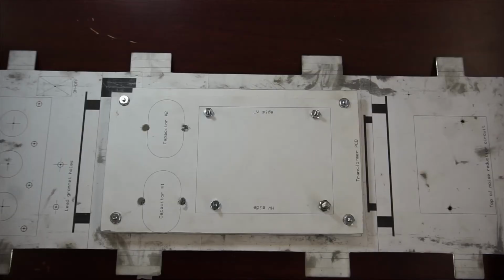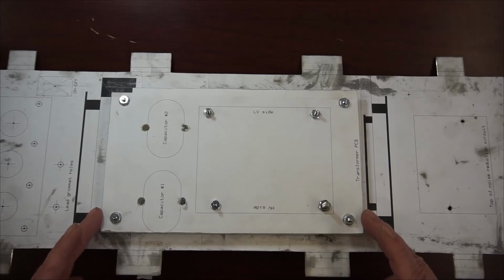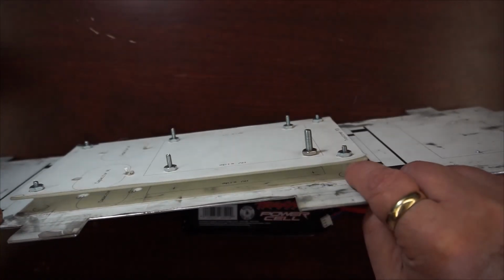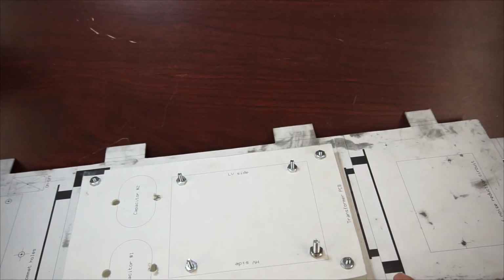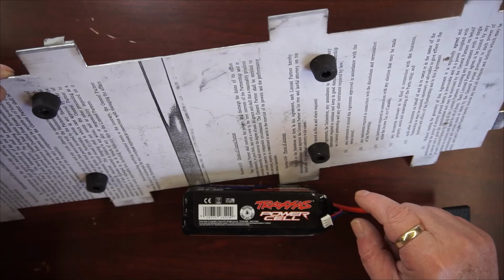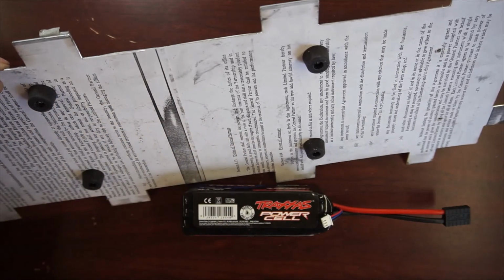This is the transformer mounting board once again, but with the transformer removed. This is the number 10 bolt that I described earlier. Here, the transformer mounting board is secured to the power supply base. You can see that I've used nylon spacers again. They keep the bolts which actually touch the transformer's frame away from the sheet metal enclosure. As I turn over the base, you can see that I used the mounting bolts for the mounting board to secure the rubber feet in place.